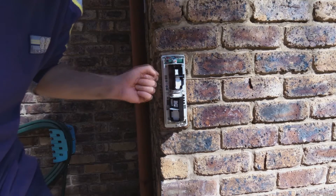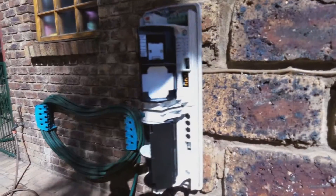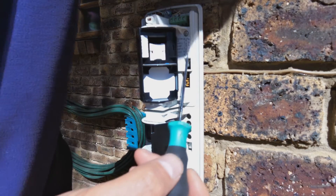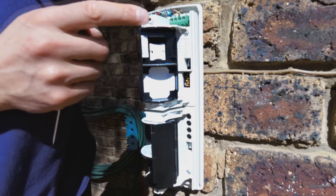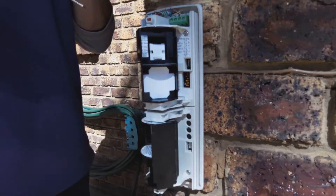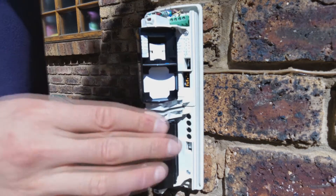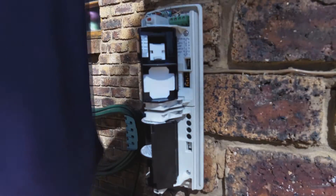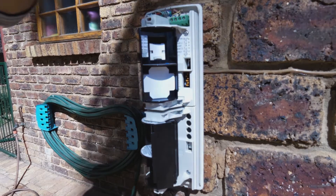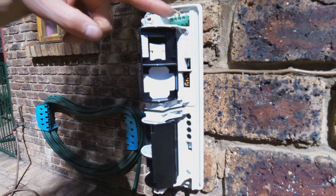There are also dip switches, some for the top and some for the bottom sensor. The dip switches give you options such as the LED indicator - it lights up when someone is near the unit. There's also a count feature: you can set it so that a single motion trigger won't activate the alarm, but if it picks up three or more triggers then it initiates an alarm.